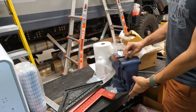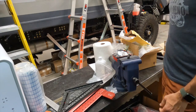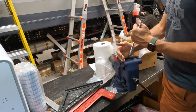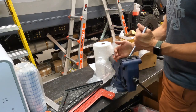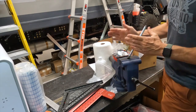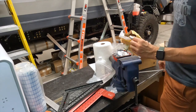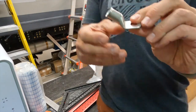I'm going to take my lug and clamp it down in a vise, then take a threaded rod that is just a little bit smaller than this lug. All I'm going to do is simply bend this down. These are copper, tin-plated copper lugs — a pretty soft metal — so as long as I have the lug laying flat and straight and I'm pulling it down straight or pushing it away from me straight, it should bend easily. I just need to make sure I have enough gap between the flat part of the lug and the bend.